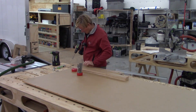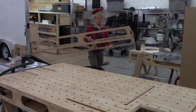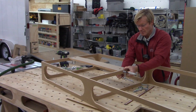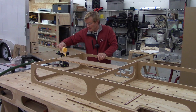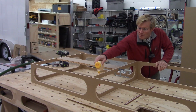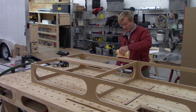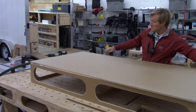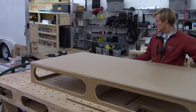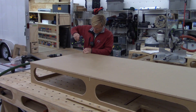I'm going to make a spacer with a couple of holes in it that I can clamp in the frame just to keep the middle spreader exactly parallel to the side. When I push that one end spreader in flush to the edge of the plywood, it will automatically set the center spreader up. Of course, glue — glue is what holds things together and makes it last and makes it strong.